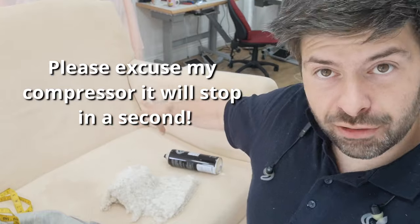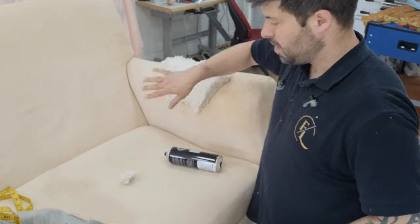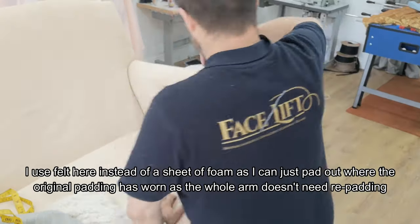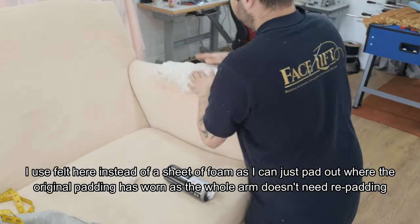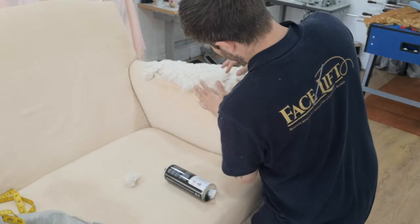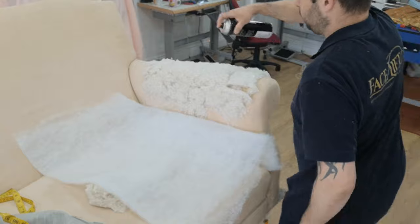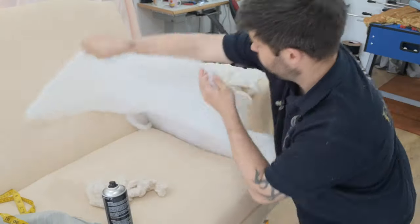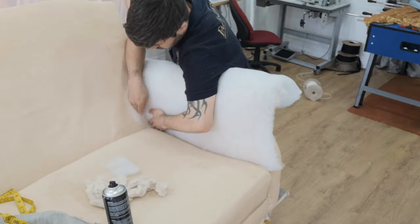What I'm doing now is putting some padding on this arm, using some soft felt on there. I'm going to put some wadding — some dacron — over the top to give it a nice soft feel. The good thing about felt is it's very soft and easy to manipulate, so you can make lumps and bumps disappear with a bit of felt, just by pulling on the sides and taking little bits off. It's a really good material to use to pad up a particular area.